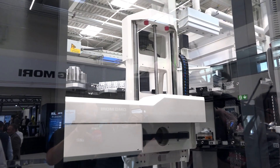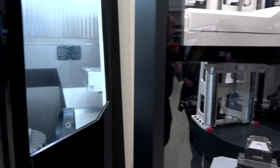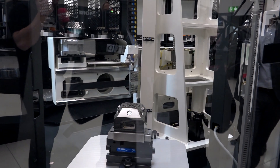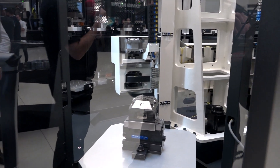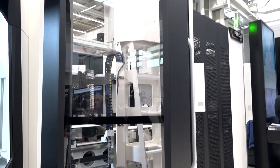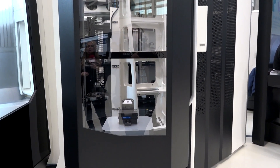The pH cell here is loading and feeding this machine, and automation is a really big part — not just here, but back in the UK. DMG Mori UK is selling a lot of monoblock machines and others with these pH cells. The versatility of these cells is a key point: they can be interfaced to pretty much any machine, and to more than one machine. You could use one to feed two machines in your shop, so you don't have to buy a separate automation solution for each machine.